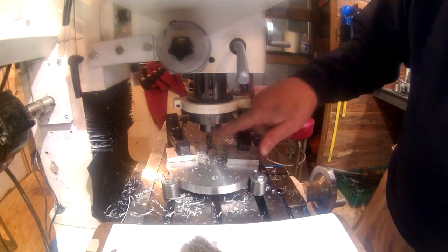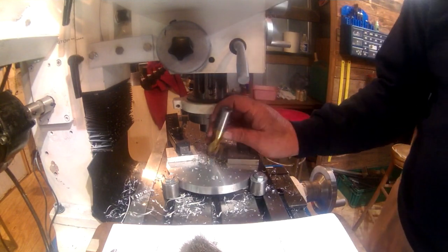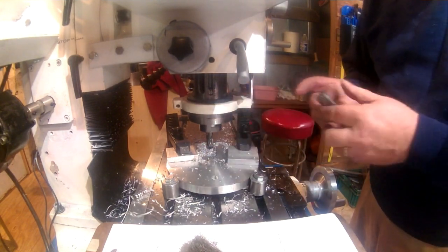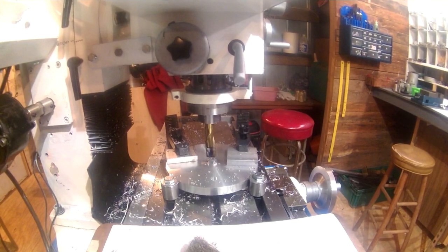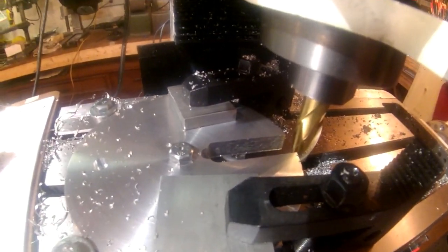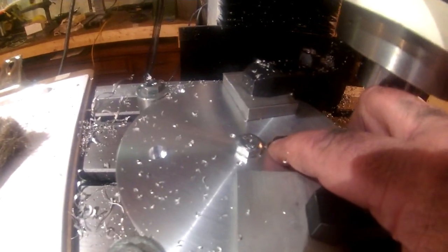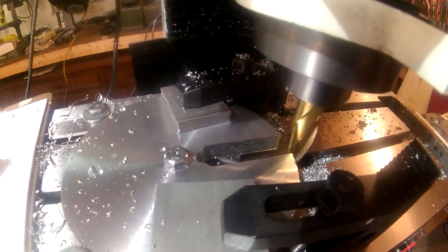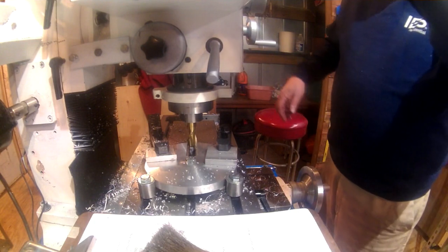And I'm going to switch out the collet and end mill and put in a 3/4. That's going to clean our vein out both sides and bring it right up to that witness mark that we made in the inner ring. Okay, I'm going to go handheld just a second, bring the camera around here so you can see what we've got. With the roughing end mill, we made a center pass, we moved over and got this side, we moved over and got that side. And you notice I left short on that. Now we're going to take this 3/4 and bump right up to the inside of our internal witness mark. Now we're ready to see if everything is secured good enough to hold this 3/4 inch end mill.